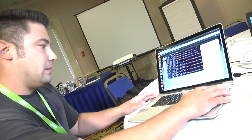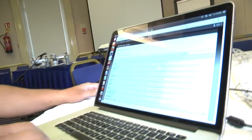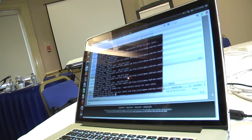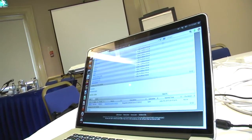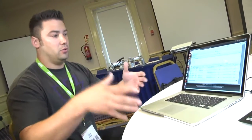I'm going to submit a job for my BeagleBone Black in my lab back in Washington State, and we have eight BeagleBone Blacks here in Dublin, and we're also going to run the jobs at the same time as this LAVA server running as one entity. So the first thing I'm going to do is submit a job to my BeagleBone Black in Washington State. We can see that we have one running — the scheduler decided to run it on its own. But now we'll launch all the jobs — we're going to schedule 10 jobs. The scheduler will arbitrarily pick these BeagleBone Blacks both in Washington State and here in Dublin to run jobs on.